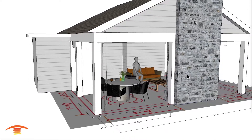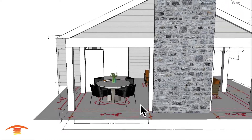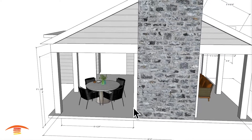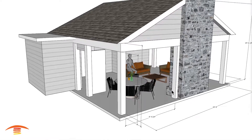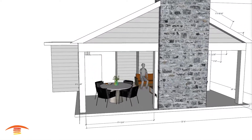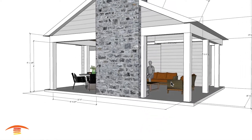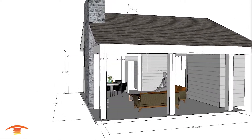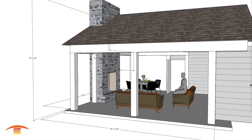If it's completely open like this, with the electric heaters, if you looked at the slab itself and the amount of square footage here, it would call for seven-plus heaters to heat this whole entire space properly. We're not going to heat up the entire space because I think seven units would be quite a bit and not look appropriate. I think we can get away with a little bit less than that, so we'll go ahead and look at the options for that.